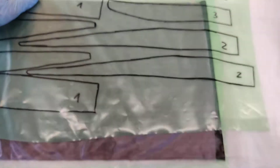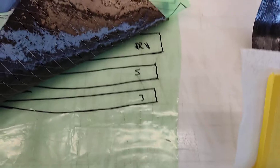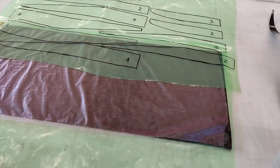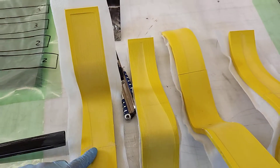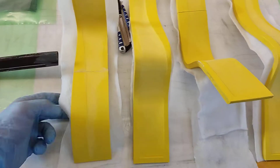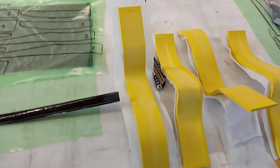Below those 45-degree layers I will add this unidirectional carbon fiber. The stencil is underneath here. After wetting everything out I can cut every part and then just stick them onto each other and bag it. To apply a release film on top of this mold I will use a vacuum bag, and there is breather cloth underneath so the air can distribute well.